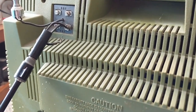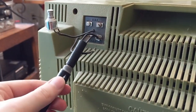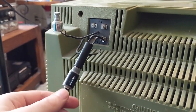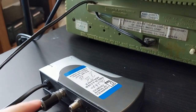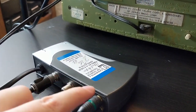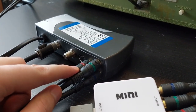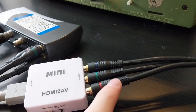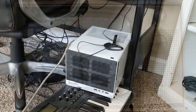Starting with, we hook this up to the VHF input on the TV and convert that over to coaxial RF, which goes to this converter box I got at Goodwill for about three bucks. This converts the RF signal over to an RCA signal. From there we go to another converter box which takes the RCA signal and turns it into an HDMI signal, and then that is plugged into my gaming computer.